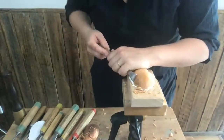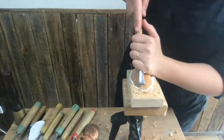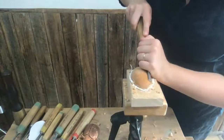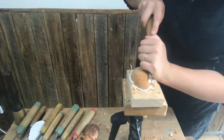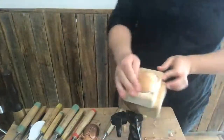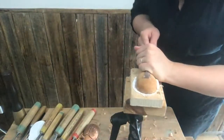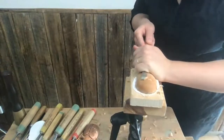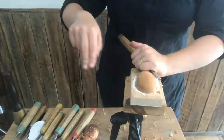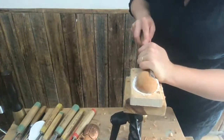Wiggling that there. Each wiggle is a different separate cut as I hit a bit of tough grain. At least with this one, you'll see how to really get your way out of fibrous, misbehaving timber. Now I'm just going to spin that around because I've got a few chunks up here. If anybody watched the stream on grain direction, it's all the same principles in this. It's just we're not carving 2D, we're carving that way, so 3D, but it's all the same principles.